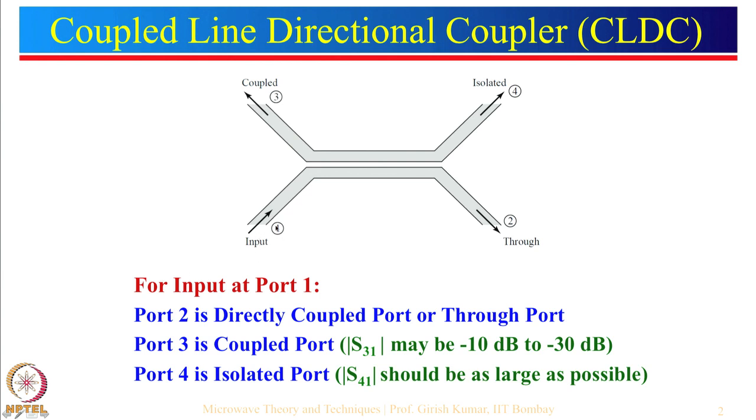To give a little idea: suppose input is 1 and the input at all other ports is 0. Applying input of half here and half here — plus half plus half — actually gives us even mode symmetry. Then we do the second case: plus half here and minus half here, which is known as odd symmetry. The final analysis is done by taking the sum of these two things: plus half plus half equals 1, and plus half minus half equals 0.